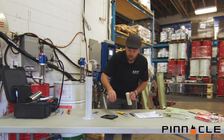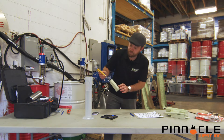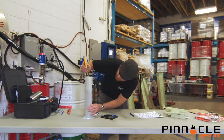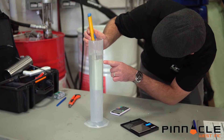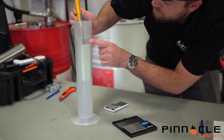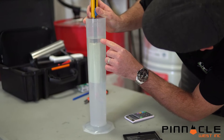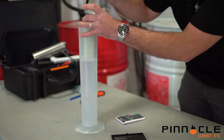Once we have our weight of 9.2 grams, we know our starting volume is 700 milliliters. I'm going to pierce the sample with my knife and then drop it under the level of the water. Reading the cylinder — each gradient represents 10 milliliters — I'm at 910, 920, and I'm approximating that to be 925 milliliters.